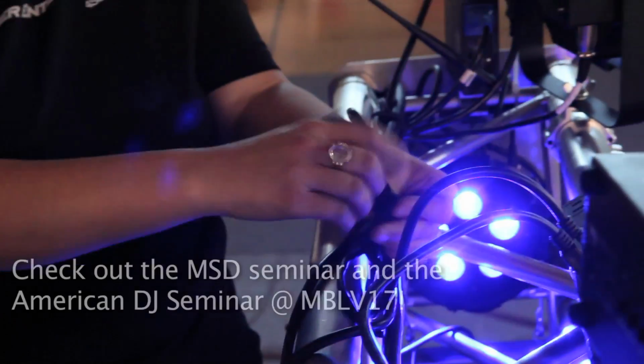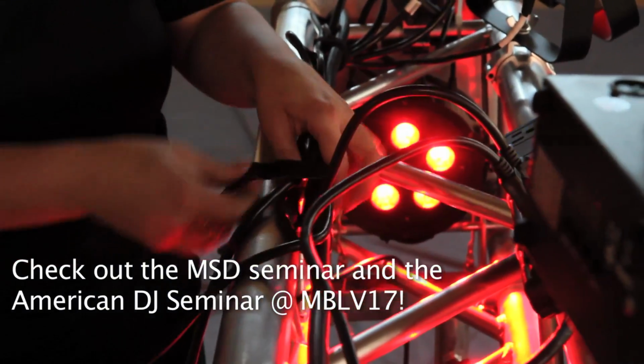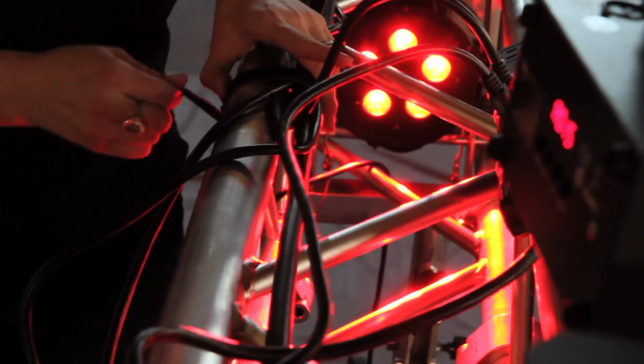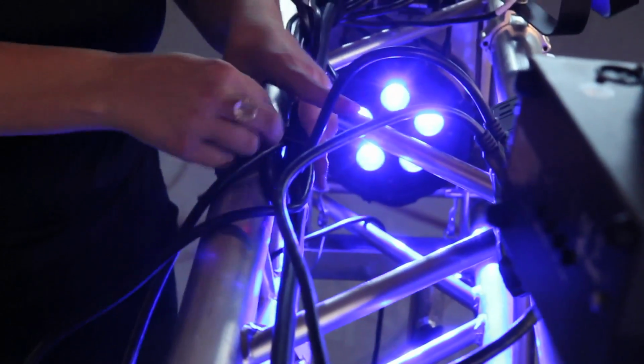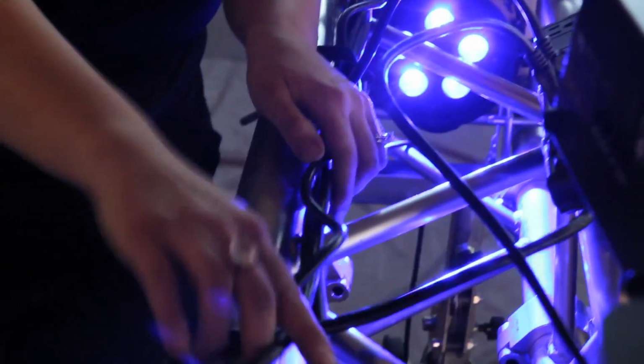That's right, people. Attend the shows. Get free swag. Also remember, those of you video guys, your S-video should be run inside the truss, and everything else on top. This prevents your S-video cord from being too close to your power and picking up that lovely 60 hertz interference that we all love.